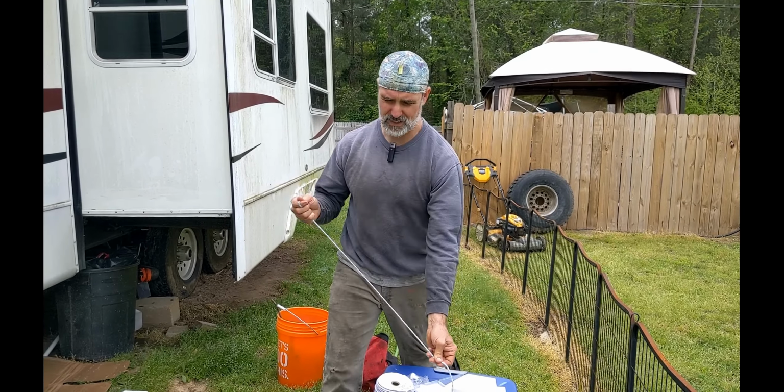I'm going to come in 1 1/4 from the edge on both sides. Those will be my holes that I'll drill so that I can put screws up through. And the screws will engage this block right in those spots right there. I'm having to mark again. I already drilled the holes previously. The math that I showed was correct, but my measurement from center to center under there is wrong. So we're going to have to do a take two here. This was originally going to be the bottom side. I'm now going to make it the top side.